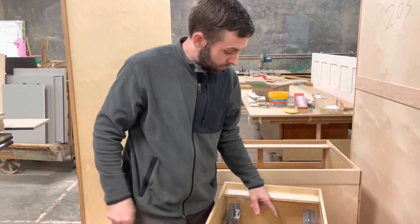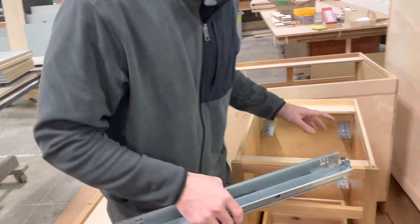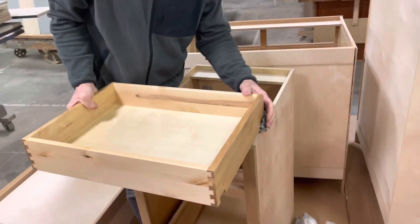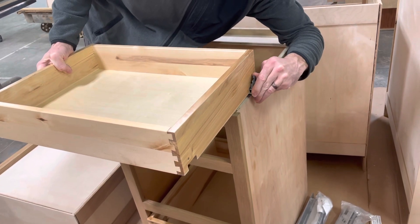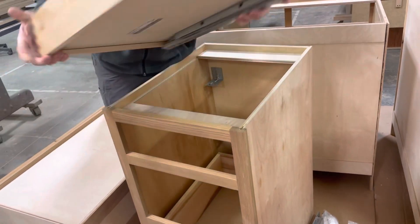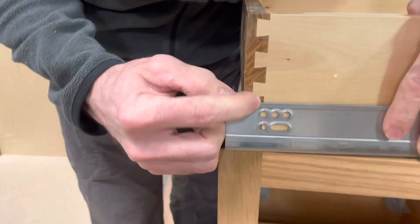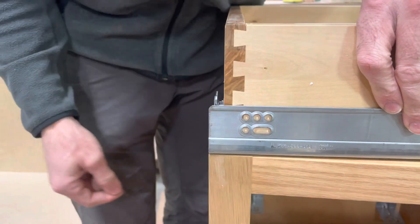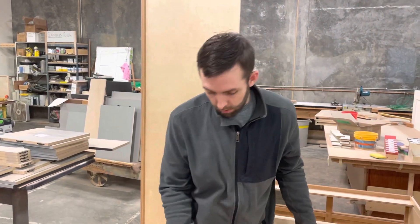You can be successful in leveling your drawers. These drawer slides come with a rear bracket, so hand me that drawer and we'll use this as a demonstration. When you raise this up — do you see how much gap is between there? When I adjust it down the other way, see how that dovetail disappears. So what I'm doing is raising or lowering the back of the drawer.